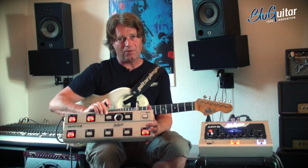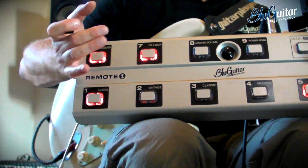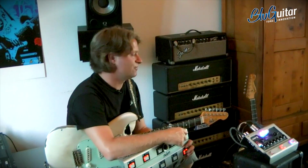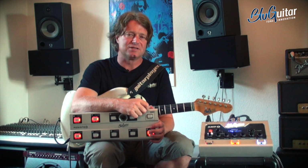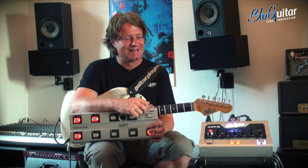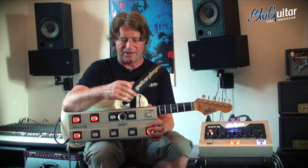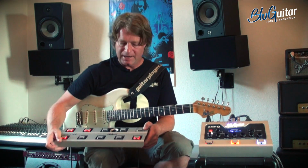So anyway, the power soak that I have on my AMP1 works in a different way. It actually reduces power inside the power amp section, but it's not using resistors, and it doesn't convert this extra power into heat. This would cause some extra problems which I don't like to have. So the power is cut inside the power amp stage, so it doesn't get out of the amp. But first I have to show you what it sounds like.